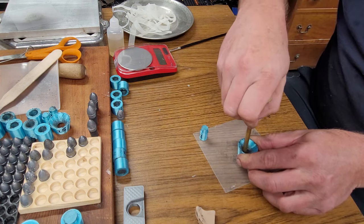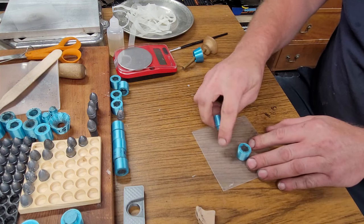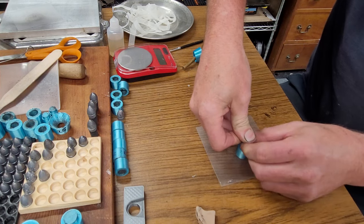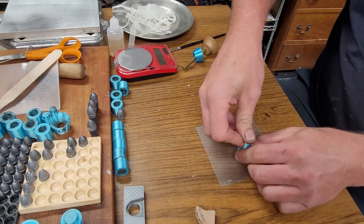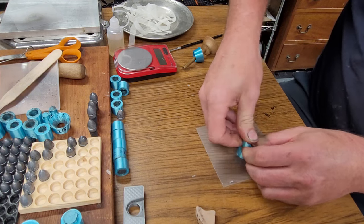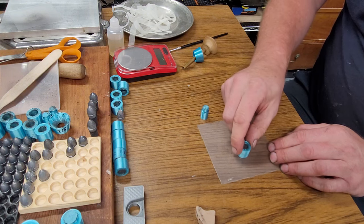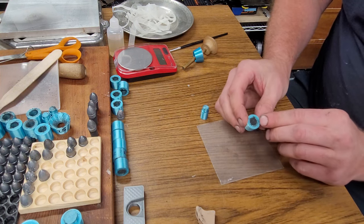And so after it's packed in there, you want to lift the funnel off, so you'll be left with something like this. And just push this in as hard as you can to compress the powder. On the second factory, they went from the hammer, the mallet and the iron bar to a screw press to do this process. So just press that in, and then it'll sit about a millimeter below the mold here. And then I slide it around a little bit and pop it off. So that's the bullet side, and this is the bottom.